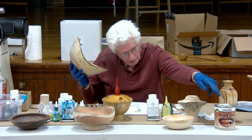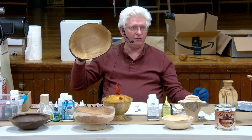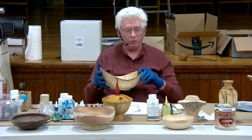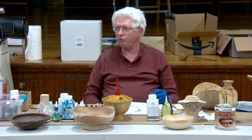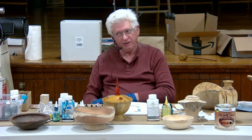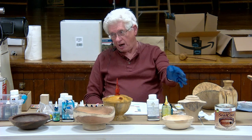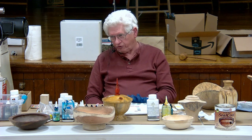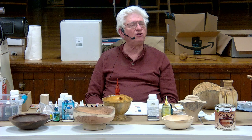On a piece like this, it will be sealed before I put on any colorant. I seal it with the Zinsser product — it's a shellac-based product that stops that weeping all the way through the piece. The reason it takes the color is because Zinsser shellac is alcohol-solvent based, and that's a big point — if it's not alcohol-solvent it doesn't do the same thing. You put on your Zinsser, let it dry, then add your color. Be very judicious because you can solvent that first coat off and it'll bleed through.